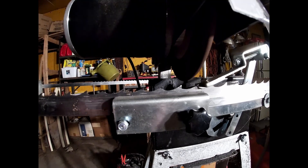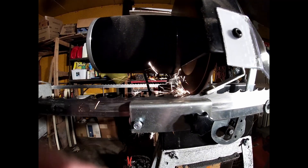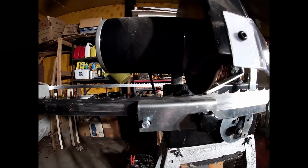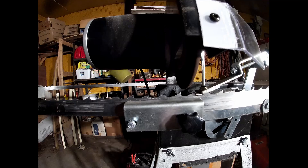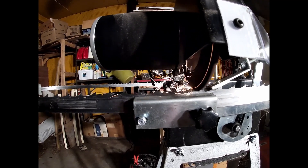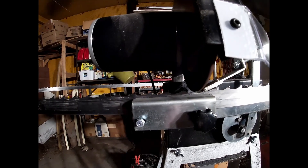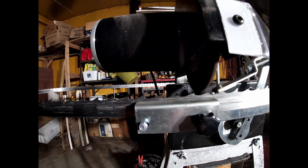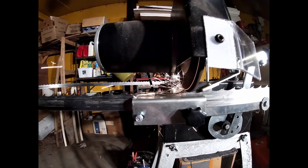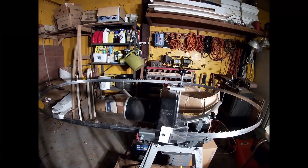You've got to remember this is going from a 10-degree blade to a custom grind 8.5-degree, so I'm not getting the whole face of that tooth — I'm just getting the very tip of that tooth this time. Next time I'll get a little bit more of the tooth, and the time after I'll get all of the tooth. I could let it go around three times and get the whole tooth, but this sharpening is good enough and that'll cut a lot of pine or a lot of oak. Just that little tip is all you have to sharpen. On the back of the third sharpening I'll be back to a total 8.5-degree sharpen. And that's it — that's all there is to it. Grind-Lux 4000, made in Sweden.